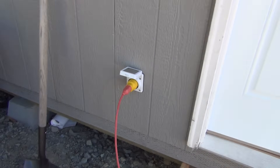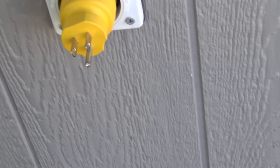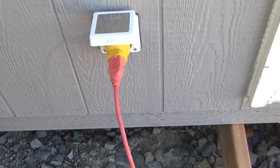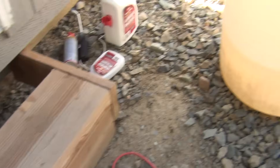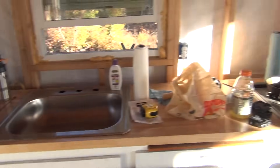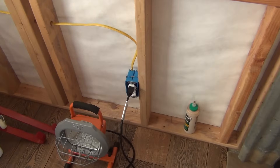We are plugged in here with the sort of shore power system. I had an adapter so I can actually run a 30-amp hookup if I were to have a bigger generator. I got this one because I can get a nice standard extension cord adapter for that, to avoid that dangerous dead man's cable situation. So we are officially wired up on this half of the cabin. I cleaned up my work, stapled everything down — it was supposed to be every four and a half feet. I have a lot of extra excess in there and I'm going to be replacing this cable, picking up some 8-gauge or 10-gauge wire. It's not going to be running that much amperage on this thing.